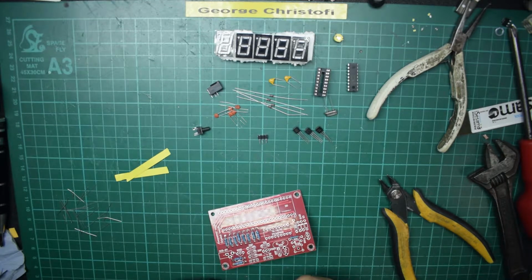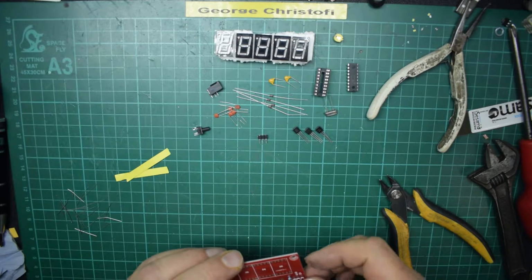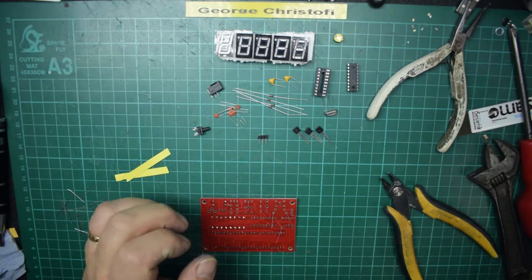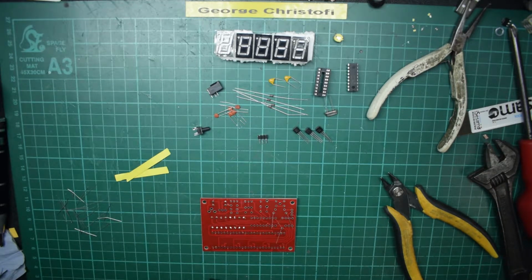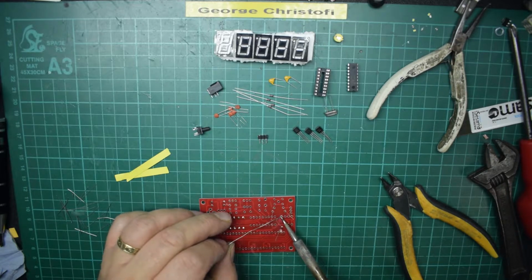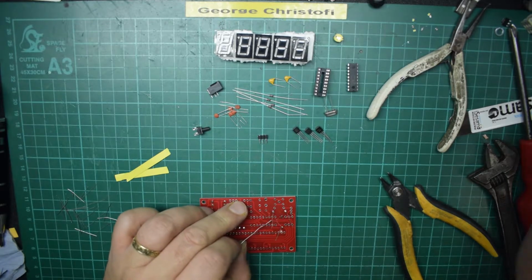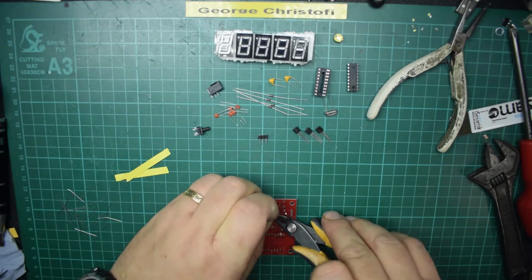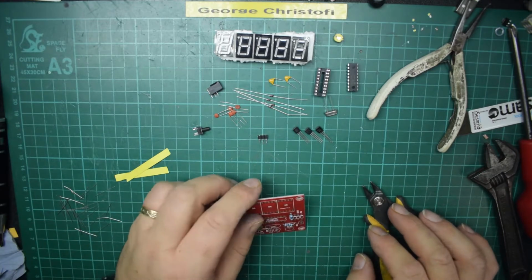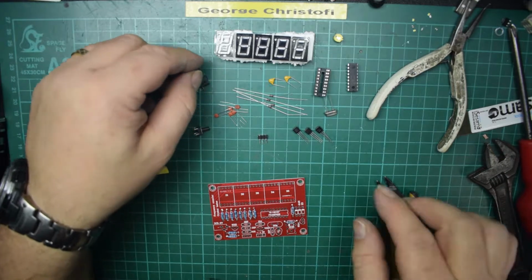But you can pick up a Chinese multimeter for about a fiver. You can certainly get them from Maplin's, although I don't like saying that name out loud too often. I think even Poundland don't do them, but certainly Wilco's I think do. Halfords, I think they sell multimeters. They sell them as car testers, but they're effectively the same thing. They're multimeters, and you just buy a cheap and cheerful one. Whether you get a digital one or an analog one is up to you. Both have their merits, and in some cases the analog ones are better, unless you've got a top of the range digital one, of course. Because of the way the needle moves, you can actually see various changes, whereas with a digital one it just flickers and you don't actually know what it's saying.